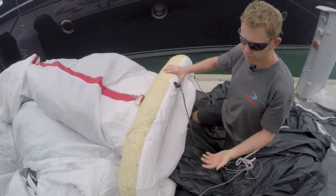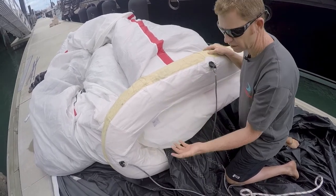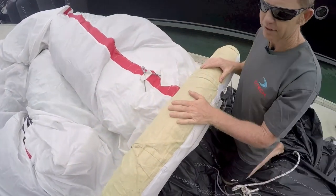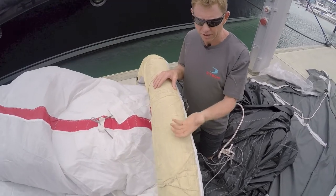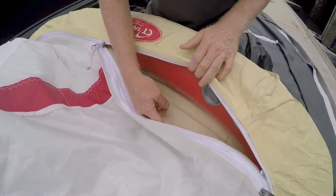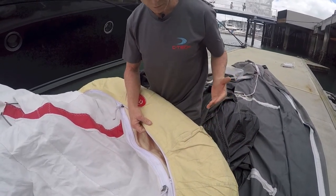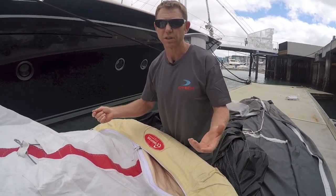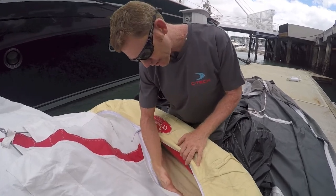The chafe guard itself is made of three different materials. The first material at the bearing point where the spinnaker goes in is incredibly slippery — we've actually developed this material ourselves and it's PTFE, so the spinnaker will bear on this extremely slippery PTFE material. The next material is Kevlar, which is there because it's extremely good for when a rope abrades over it and tries to saw through. So Kevlar is a very good material for protecting the bladder. On the inside we have a heat insulation layer as the third material. When pulling this whole unit down over a spinnaker length of say 55 to 60 metres, the heat buildup is phenomenal — so much that it can actually melt the Kevlar. So this layer is there to protect the bladder.